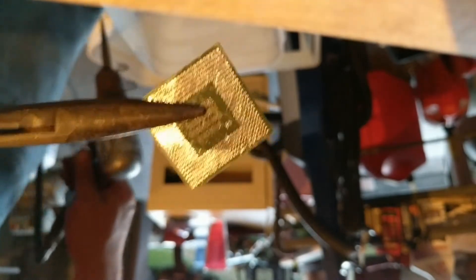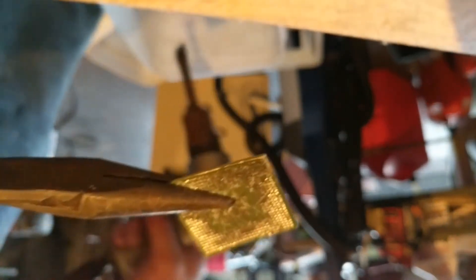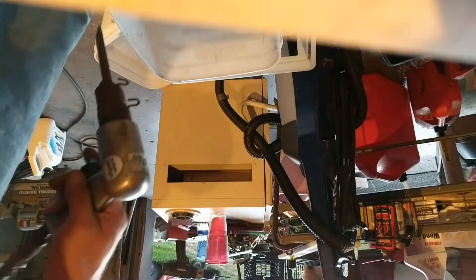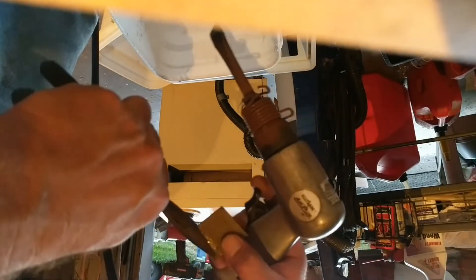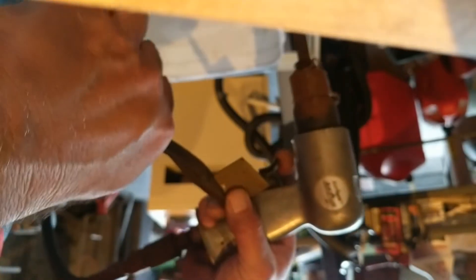Completely clean. Now all of these I had already popped off the MLCCs, so I didn't have to worry about losing those. I recommend that before you do this, remove the MLCCs first — otherwise you've got to sort them at the end.